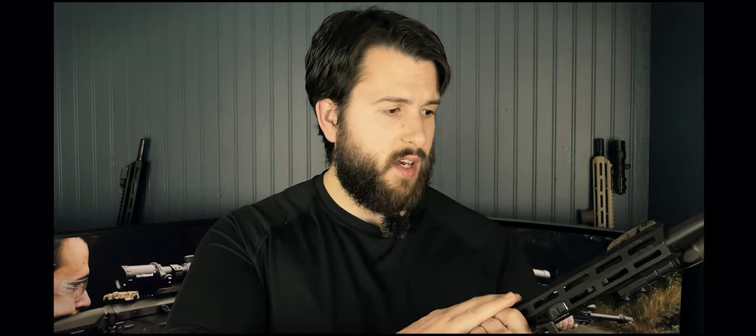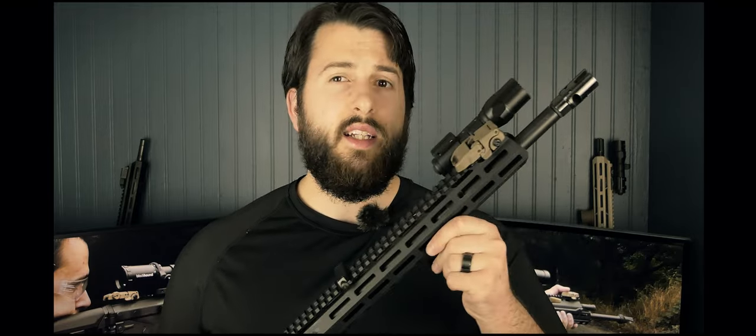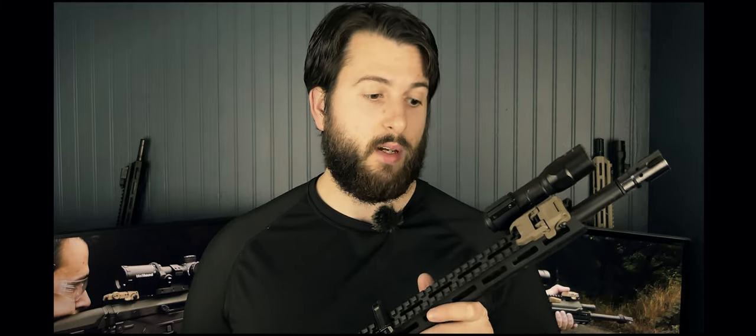This kit was $220 delivered to my dorm. The barrel is 16.5 inches, 1-in-7 twist, 5.56 chambering, mid-length gas system. The only thing I dislike about the barrel is it did not come pre-dimpled, so I had to dimple it myself. A dimpling jig is about $20 online and very easy to do if you have a drill bit. I didn't factor that into the cost, but I would highly recommend dimpling your barrel.